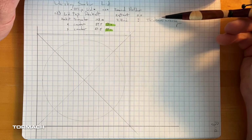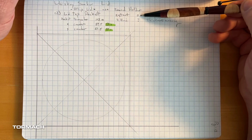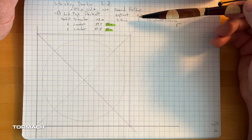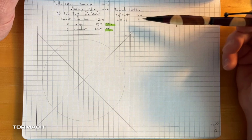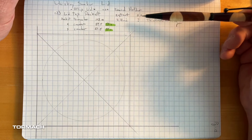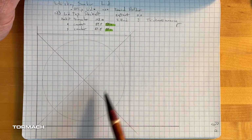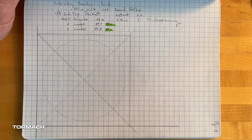So depending on the thickness of your wood, that will be your Z plunge or your Z cut that we go through. We could go ahead, because we flipped it, set it at 0, and then run that down. You should still be able to run tool 3, but if you want something a little bit longer because your wood is a little bit thicker, you can do that. And again, all we're going to do is a pocket. That way it faces it as well as separates it from the overall block. Let's go ahead and work on that.